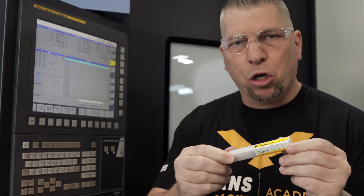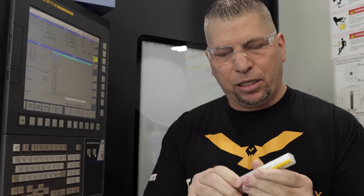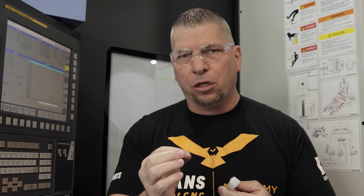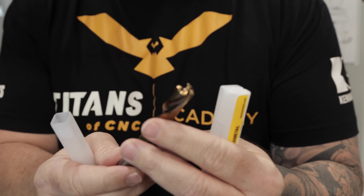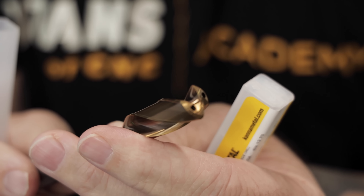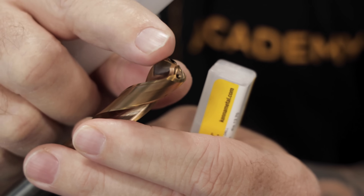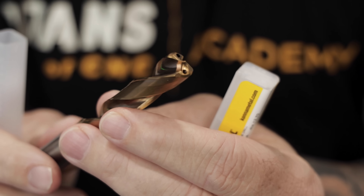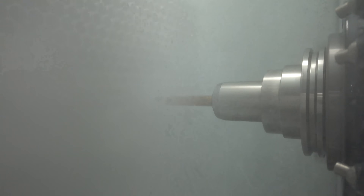This is the HPR drill — the exact drill we have in the machine that we're testing right now. It is a 12.7 millimeter drill, which equates to about .49999 inches, so it's basically a half inch. Look how beautiful that drill is — we're running coolant through it. Look at that edge, look at that point. That is a patented corner radius that Kennametal puts on these tools, and it allows us to actually go at incredible feeds. The tools last forever. We're drilling 672 holes and the consistency in that sound behind me is just a thing of beauty.